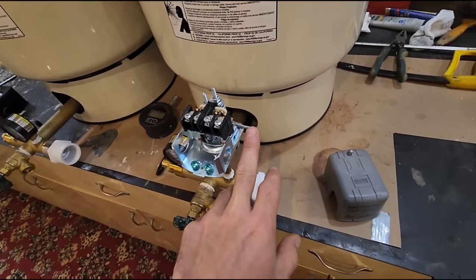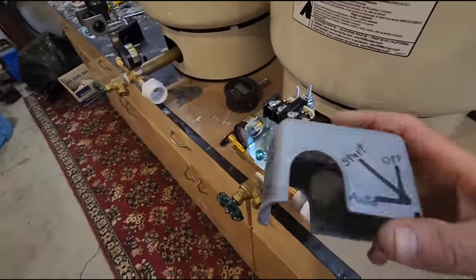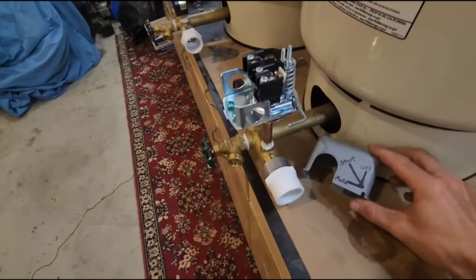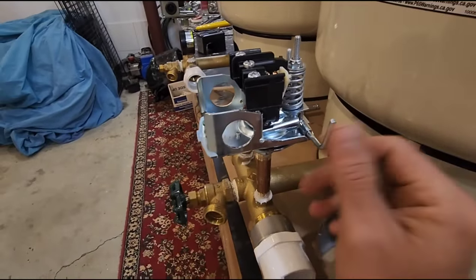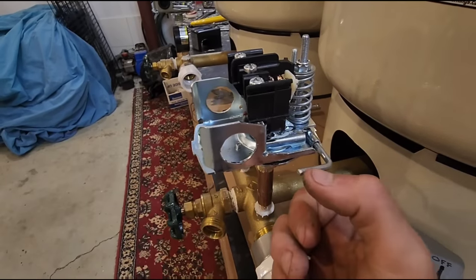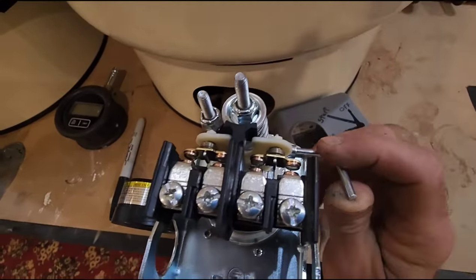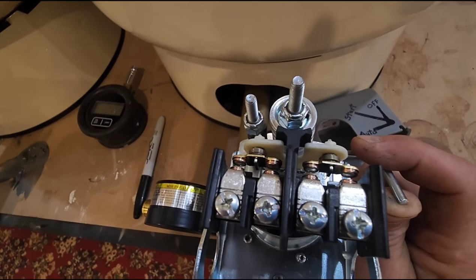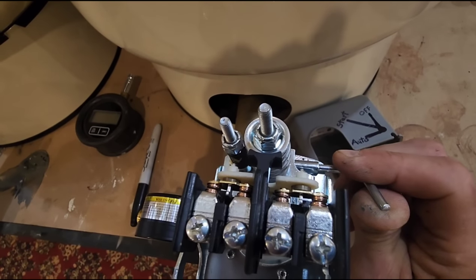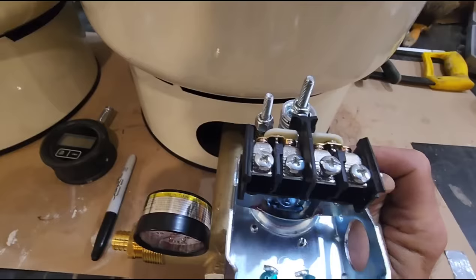I want to explain exactly how to start these switches because a lot of people have issues getting them to work. If you look right here on the side, I took the liberty of drawing it in with a sharpie. If you flip this lever all the way up, that is incorrect — that is the locked off position. When it's all the way down that's the tripped position. In order to restart your system you have to hold this lever at roughly a 45-degree angle and push up on it, holding it for a good 20 to 30 seconds.